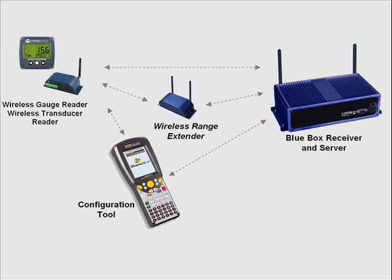The blue box receiver and server on the right hand side is much more than just a receiver. Built into the box is a relational database that can store up to five years worth of data, a built-in web server, and a built-in trending package. From any PC connected to the same LAN you can retrieve historical data, plot graphs, set alarms, and use a remote notification feature where the blue box can page a cell phone or pager or PDA. Communications are two-way — from your cell phone you can request current readings, arm and disarm alarms, and receive notifications of excursions above or below accepted limits.